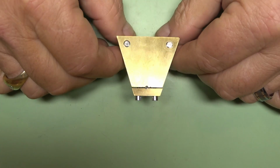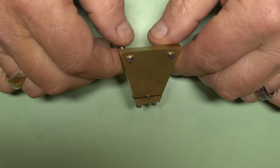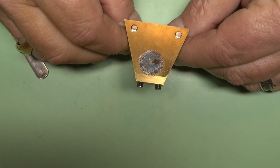Now, if you're lucky enough to have a set of hands that are completely flat, then the easiest way to polish them is with a bolt tool. This is typically used for applying a black polish to steel screws, but you can also use it for polishing any part that is flat. This is something that I'll be covering in depth in my polishing lesson in my watch repair course.